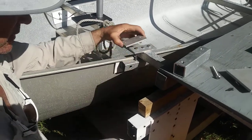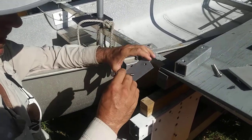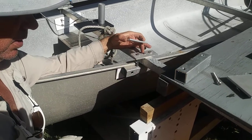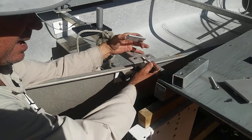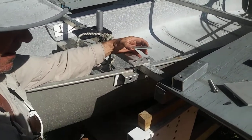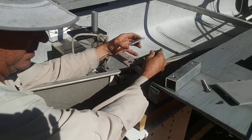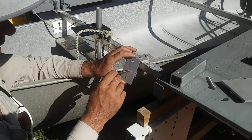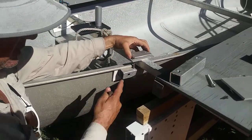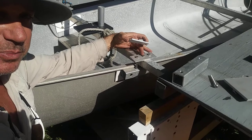After you drill the top hole, you're going to take this one and put it in. As you see here, I drilled a little hole and I put a screw in there. You're going to either have to tap it, or you can drill a quarter inch hole here and a smaller hole in the cross tube. That way you can tap this screw into it, so it'll go through here and screw into the cross tube. Alternately, you can drill a quarter inch hole in the cross tube and a less-than-quarter-inch hole here, or tap a screw in so it's held in place. That just keeps the cross tube from sliding this way and that. You can do that on both sides. This is just a pin that holds it in place — not a bolt that holds it down.